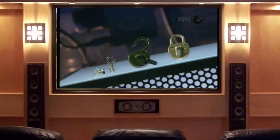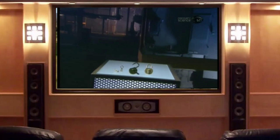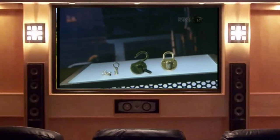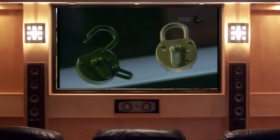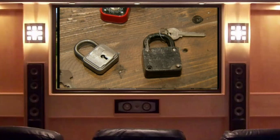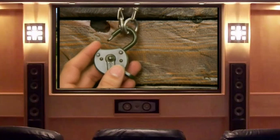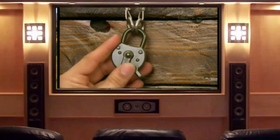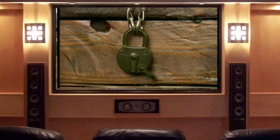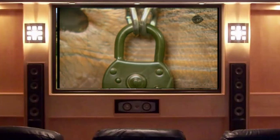The lever lock was invented in the late 18th century by an Englishman. At the time, the ward lock with its simple concentric plate mechanism was the main kind of lock in use — it was medieval technology and fairly easy to pick. The lever lock took security to a whole new level. More than two centuries after their invention, lever locks are still on security duty. The mechanism hasn't changed much, except instead of two levers, there can be many inside. They fall into slots, locking the bolt until a key lifts the levers. This lever mechanism is very rugged — it will continue to function even if dirt or moisture infiltrates the lock, which is why many armed forces will only use this kind of lock.